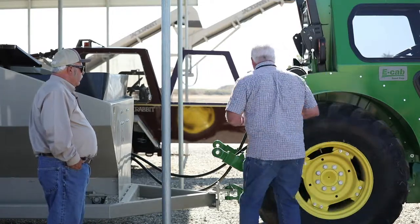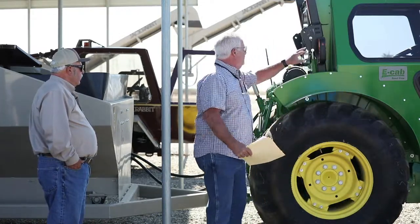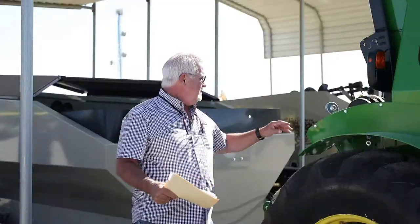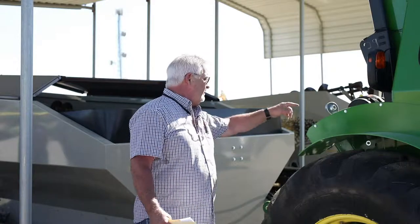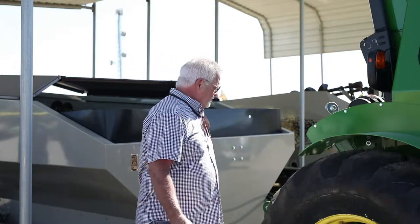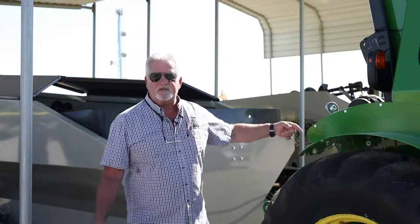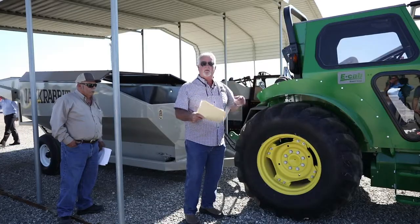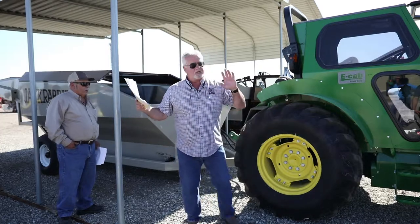This machine, when you do hook it up hydraulically, a tractor like this, in order to keep the hydraulics as cool as you can, you use a pressure, and you can talk to your dealer about this, but use the pressure implement port here to pressurize the cart and bring it back into the sump of the tractor, not back through the other port, because every time you create more resistance, friction, it makes heat and everything gets hot, and that's not good for everything.